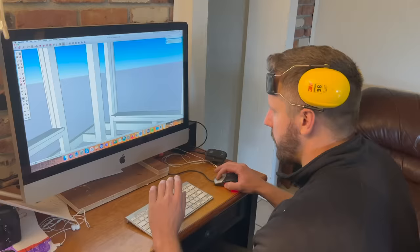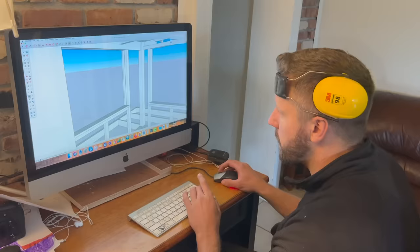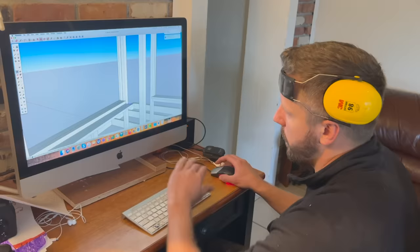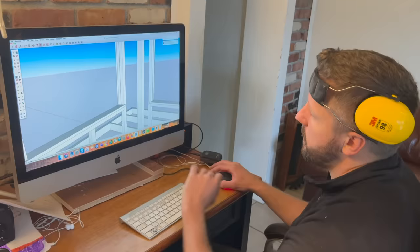And the only part that'll come through is the window sill here. So I built the frame that'll be flush on the bottom, and then you can see that the window sill will slide in from the front. And it'll cover the gap and everything between the window liner and the bottom. So it'll look more built in there. So there'll be a little sill coming through, and then the timbers will just act as the trim.